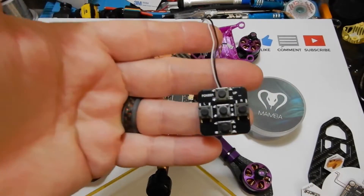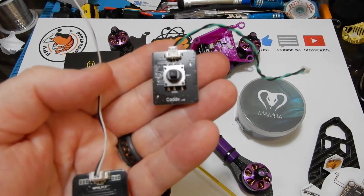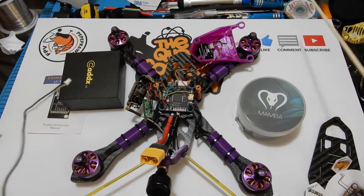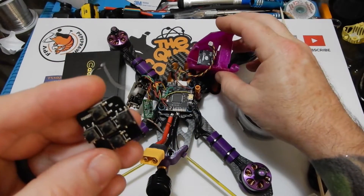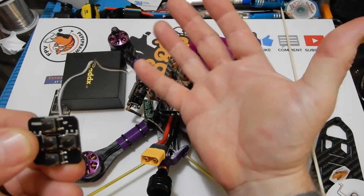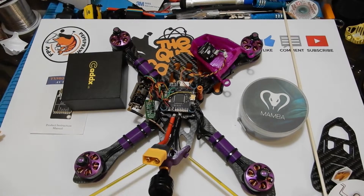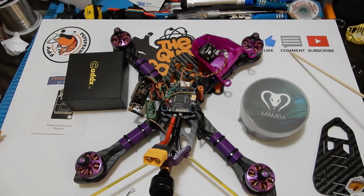The problem we ran into was we need to get rid of the OSD on the camera because we're going to use the OSD on Betaflight. I could swear I got the single-button controller in the box, but I have so many in my desk I can't remember. What you're going to need is one of these five-button camera controllers — the Foxeer one works, or the Caddx one. You plug this into the lead coming off your camera with the wires connected to the controller, then hold the left button down for five seconds. That brings you into the controls where you can shut off all the camera OSD and use the OSD that comes on the Mamba stack. Usually it's in an obvious spot, but on this one you had to do it a different way — holding the single stick to the left did not work for me.